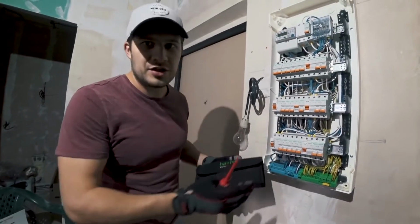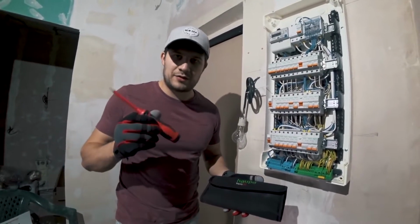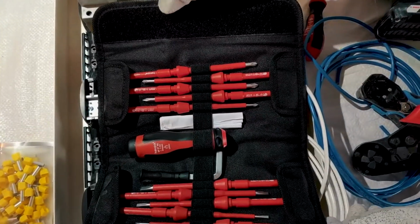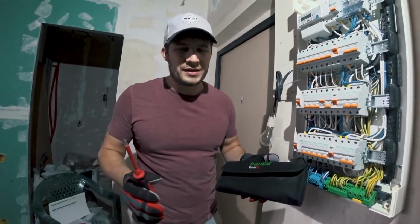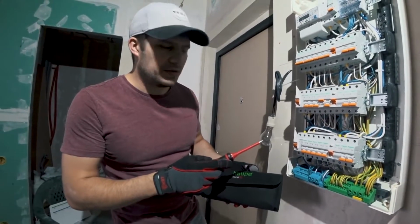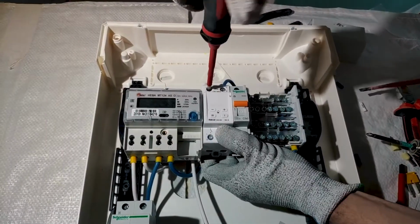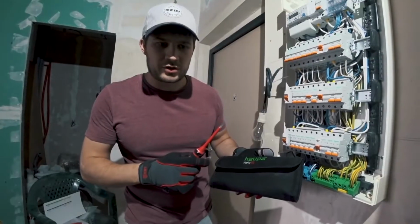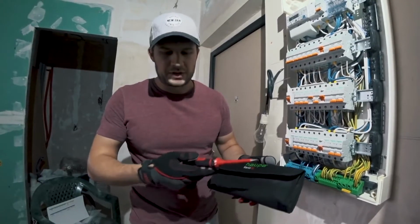Something I wanted to mention about the breaker panel. When installing the breakers, it's important to torque them to a spec using a torque screwdriver. Up until recently, we were torquing them by hand. Everyone was, and you might say that it's not necessary, but there are times where it's absolutely necessary. For instance, for a regular breaker, the torque is 3.4 newton meters, but the cable transitional bus bar uses 2.5. So there was an easy chance to over-torque it and crack it.